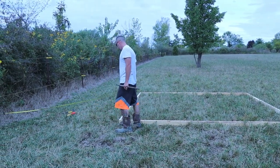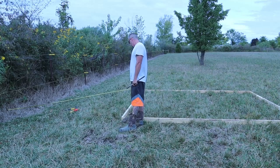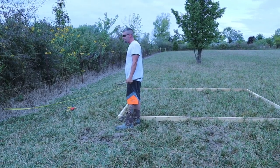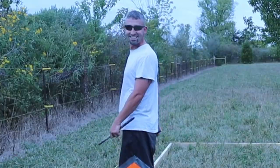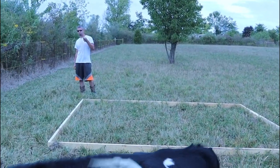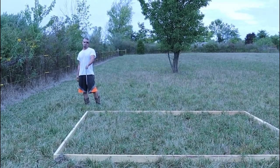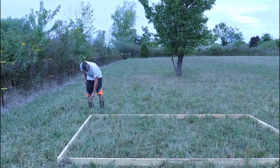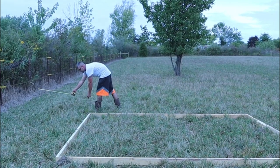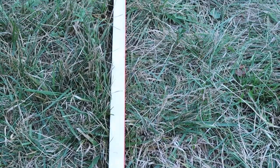I come off 100 inches from the fence — whatever distance you want — because I need to be able to take a tractor around the back side, so just under nine foot works. I went 100 inches because it felt right. I stake a pin 100 inches off the fence, then come 16 foot off that pin — I'm two foot offset outside each corner, so 12-foot box plus two plus two equals 16 foot. I sink a pin and run a string line from pin to pin, nice and tight. That gives me the starting point for laying out my box.